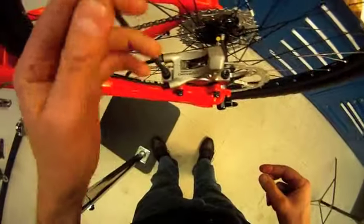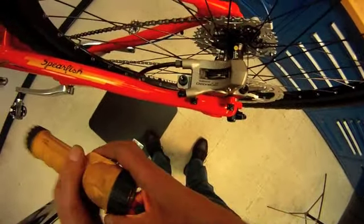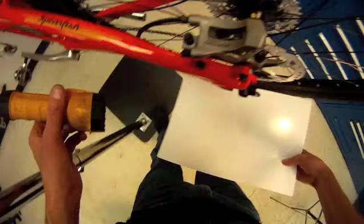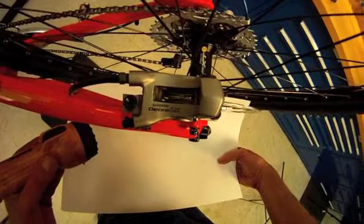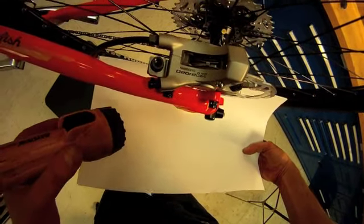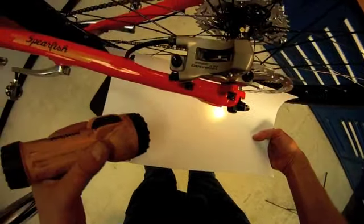No more squeezing until we get this on and give it a spin. Now we're looking down, and this can be difficult to see at times. A flashlight shining from above doesn't really help. What can be quite useful is shining a light from below — get white paper and put a light down on the paper. We can look down and see the light gaps, and that tells us the clearance. The hydraulic systems have a rather tight clearance, so a nice bright background light is where you need to see it.